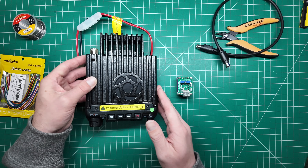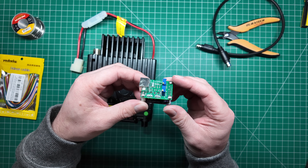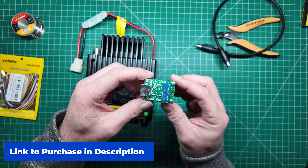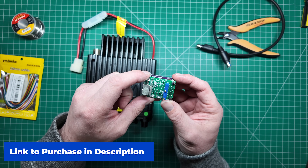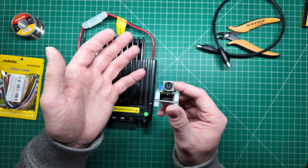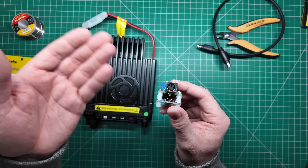This radio will be interfacing to these little boards here. On the bottom is the TOADS DI, or digital interface — that little purple board — and it is connected to the TOADS DI6 daughterboard. What this does is break it out to a six-pin DIN connector, the standard found on the back of most radios like Icom, Yaesu, and Kenwood radios.